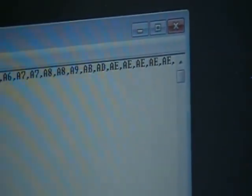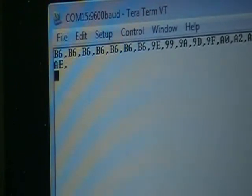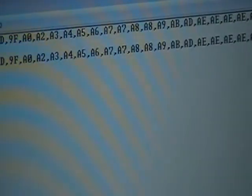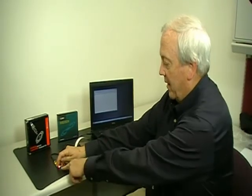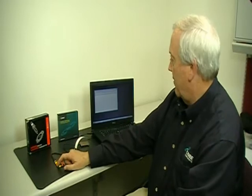I can push the reset button and bring that data out again — the two lights alternately blinking means it's ready to read out again, and it will repeat the same data. To clear the data, we reset it and hold this button down for over three seconds. What will happen is the lights will blink a few times, it'll read the data one more time, and if we try to read it out again you'll just see two zeros, indicating it's empty and ready for another data logging session.